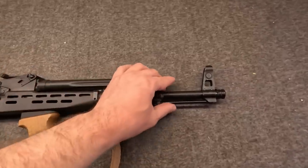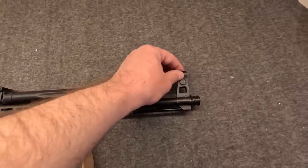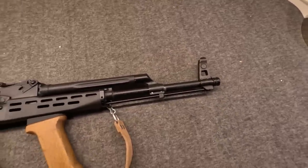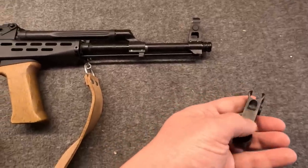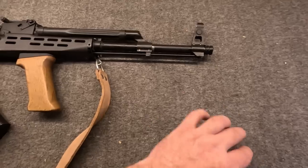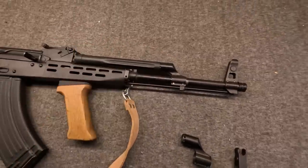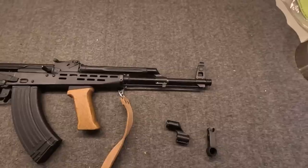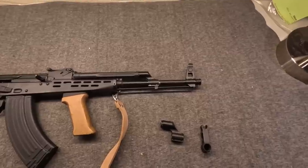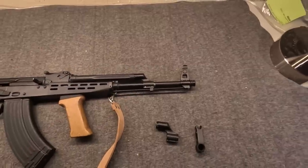Like the Romanian SAR-1, these came in in the 90s with a never-threaded barrel — meaning you can cut it. There's plenty of meat to do 14 by 1. The original front sight base even had the hole for the detent. But I noticed something when we were shooting it: with these original parts — front sight and gas block — the cleaning rod it came with was kind of walking out. That bugged me. That's something I saw back in the 90s with the banned guns, especially my SAR-2. Here's some footage from the original cabin trip — you can see the cleaning rod kind of scooting out. It didn't go flying out, but it would scoot out a little bit.